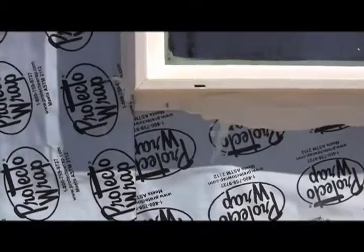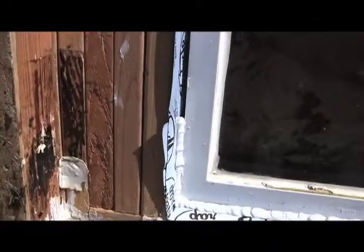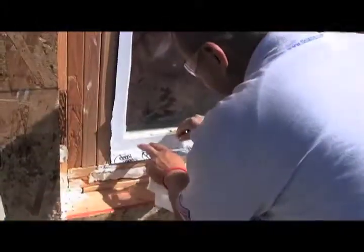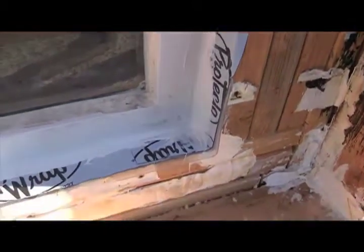Epi tools his sealant in such a way that we do not obstruct the paths of least resistance at the lower nail fins. This is where water will escape should it get trapped in our system. Now to terminate the inside of our pan, Epi is applying sealant all the way across the bottom of the window and six to eight inches up each side. Here is a clear 90-degree plastic piece — this is one way to seal the inside. He presses that into the wet sealant and it finishes off looking just like this. This does a great job of pressing the sealant underneath the window and creating a very nice finished look. The other way is to simply tool the sealant with your finger. In any event, the inside of your window should look just like this.